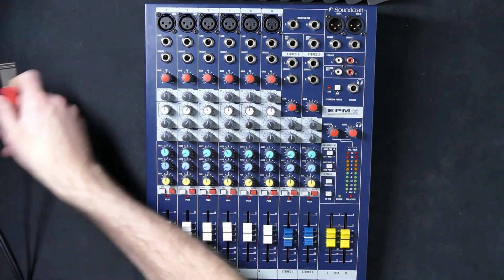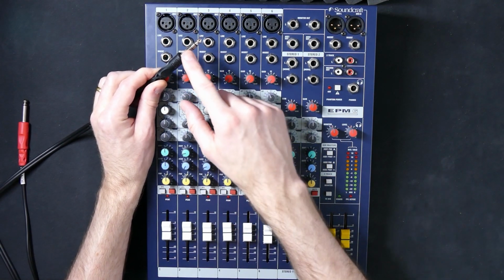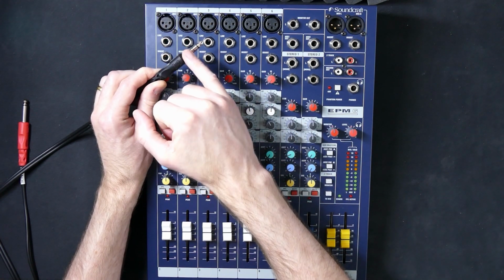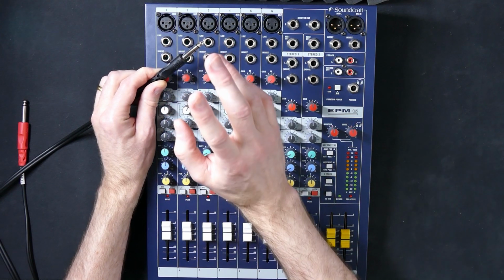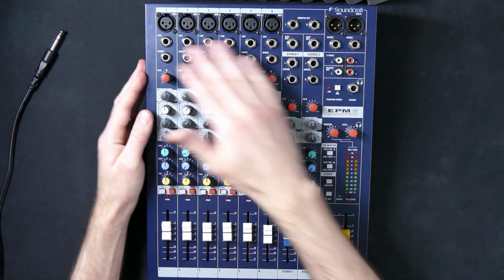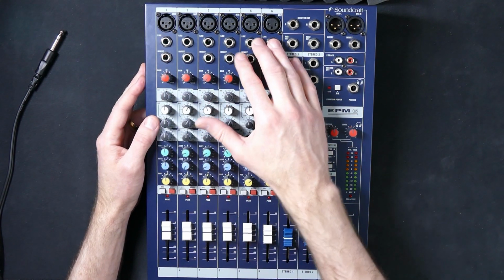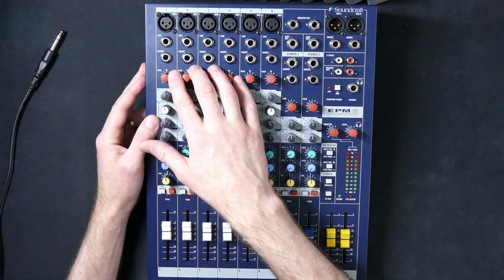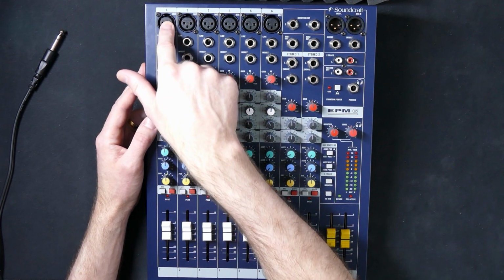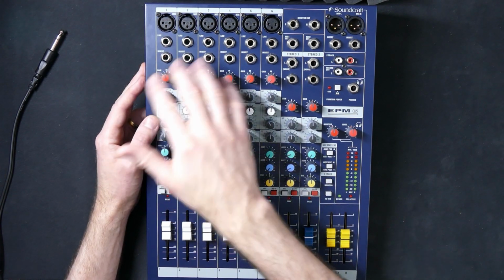So if you have a correctly wired TRS plug from a mono source, you get the plus signal and the minus signal and then the ground, and that means it's a balanced signal and you are potentially getting less noise. So you have that option. You can either have an unbalanced or a balanced input into what is a balanced socket. And I'm not sure entirely now, but I think maybe using the line will override the mic input, or certainly you shouldn't use them at the same time.